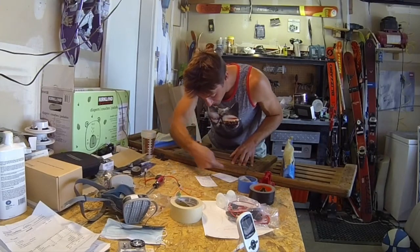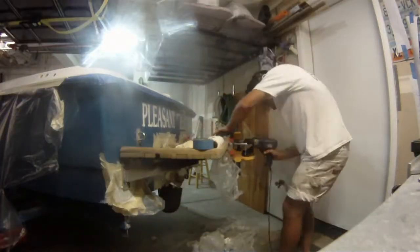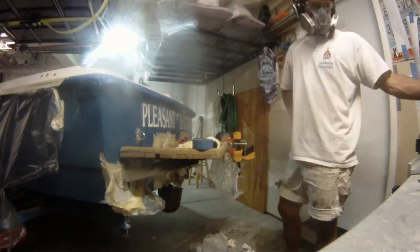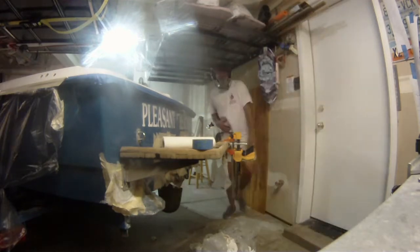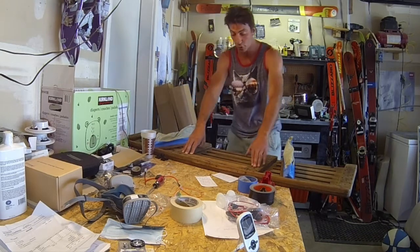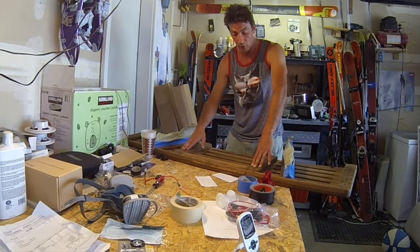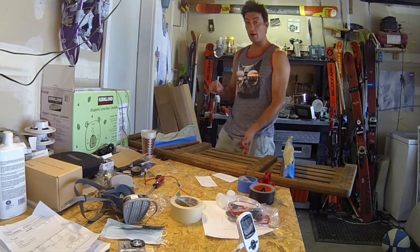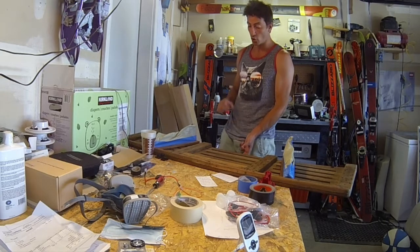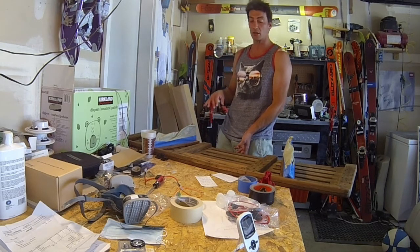I piloted all my holes and screwed in — four screws along the front, five screws along the back. The old screws were capped with some wood; I didn't cap them — I think it looks fine with the screw showing. It's repaired and it came together super strong and sturdy. I glued all the seams to make sure I had a ton of glue — it's now a continuous seam with glue all the way around so I don't have water seeping in. We've been out on the boat quite a few times now and when you stand on the swim deck it is rock solid. It's one of the things I'm most proud of in this boat build. There was no need to buy something new — it's an oldie but a goodie, and with a little paint job it's going to look dynamite.